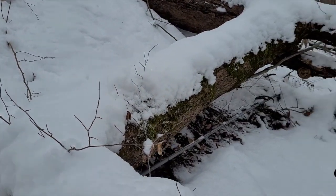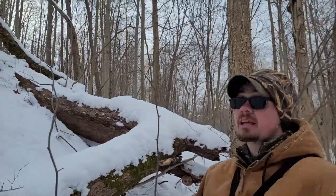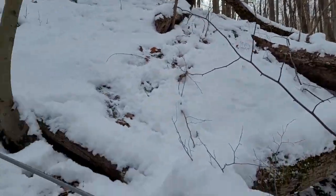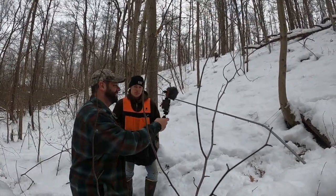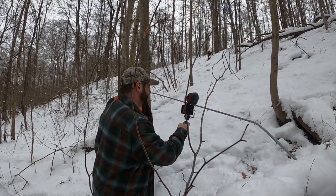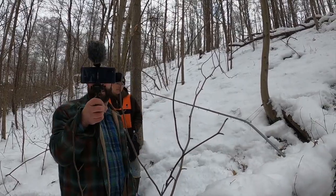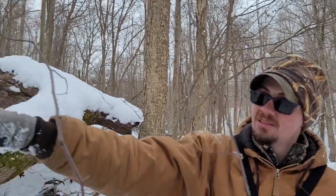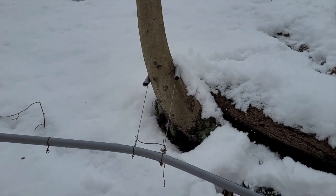So game plan, we're gonna drop out that side tie, probably the next one in that direction, and then that one there. I think that'll give us the... So you're gonna actually release the side ties. Mm-hmm. The tension off. When we string that high tensile wire to install, we usually put a ratchet on the end. That ratchet's not to make it nice and tight. That's just to get it close, and then you tighten it with your side ties. So we're pulling to that tree.